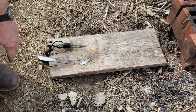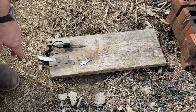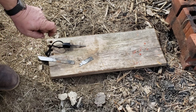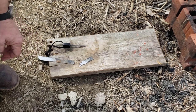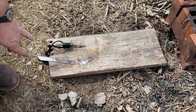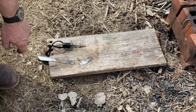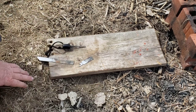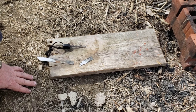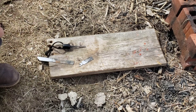You can buy high-end scrapers, ceramic scrapers, things along that line. I've made ceramic scrapers from coffee cups — I'll have to show a video on that. You can actually flint-knap a broken coffee cup into a small scraper that works really well. A piece of flint works quite well on these, or obsidian — although I'm not sure about obsidian. I've used glass, though that's kind of iffy. Anything with an edge to take that off will work — a knife blade will work, though I hate using knife blades because that does bad things to the edge. These reciprocating saw blades are usually pretty cheap, and in a lot of cases free. If you know anybody that does metal work, just have them keep a couple for you and you can have a free scraper.